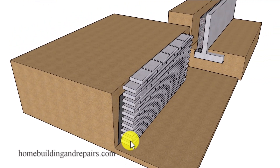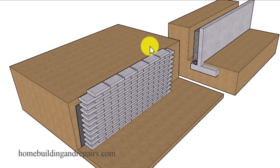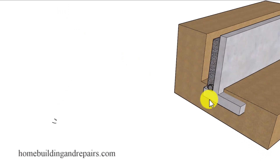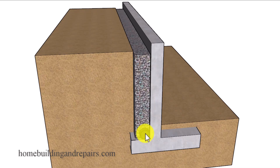An example of failure might look like the wall tilting forward at the top. Most retaining walls will also have a gravel-lined section behind them and some type of drainage system to allow water trapped behind the wall to be removed. The back of the retaining wall is usually going to have some type of waterproofing material to prevent moisture from absorbing into the wall from that side.